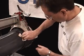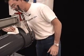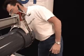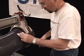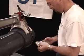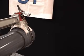Using a paper towel or rag, clean the excess cement from the outside surface of the joint. A full bead should be seen at the joint exterior. If void areas are observed, it may indicate that not enough solvent cement was applied or the pipe was not properly chamfered.